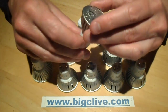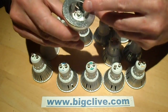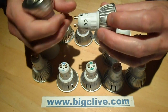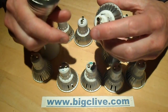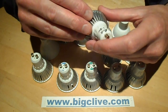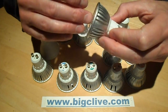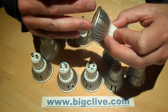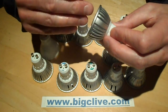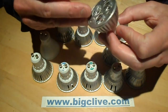The RGB lamps — I've got a couple of different types here: one with discrete chips, and one with one common RGB chip. Both were rated about 3 or 4W. This one just consistently draws around 1.6 to 1.8W regardless of how many LEDs you've got lit. If you've got one lit, no matter which colour it is, it seems to draw a constant power, and when you've got all 3 lit on white it still draws the same power, but they look a bit dimmer.